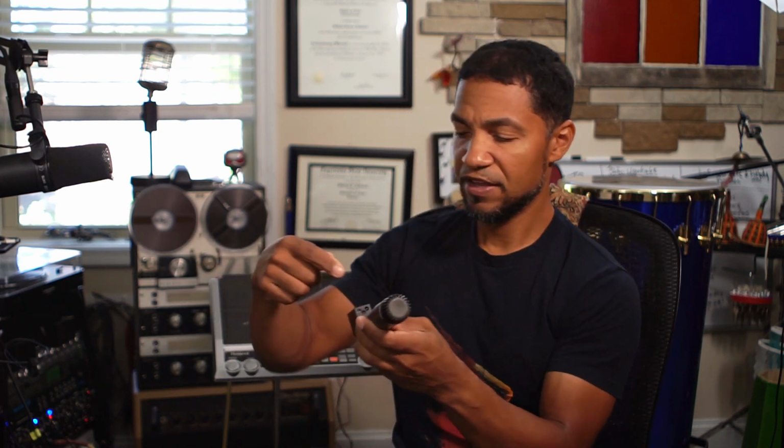And the PB-07 is for a gooseneck podium lectern type mic, where instead of the infrared being here, the infrared switch, let me grab my, there it is. Instead of being in front, on this one, the PB-07, the infrared is on the front here. So as soon as something's in front of it, then it detects it and it turns on. And usually there'll be a cable here and a gooseneck, and then you can kind of make the microphone attached to you. I actually used this one to make those sounds because I used my body to detect when I wanted the switch to turn on.